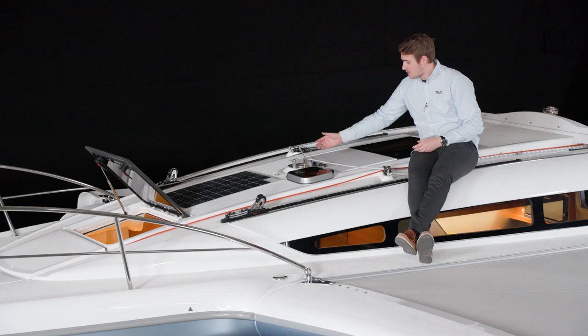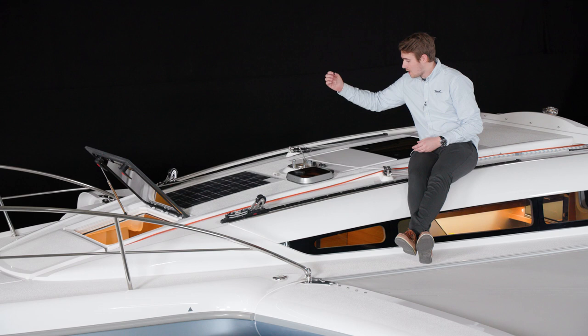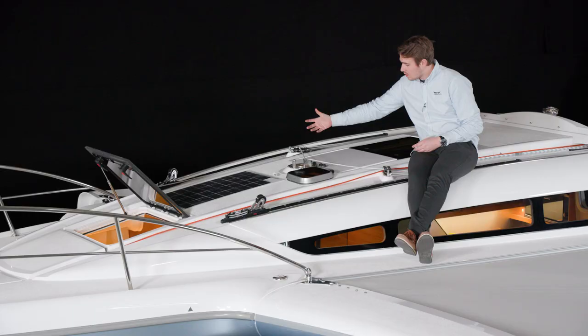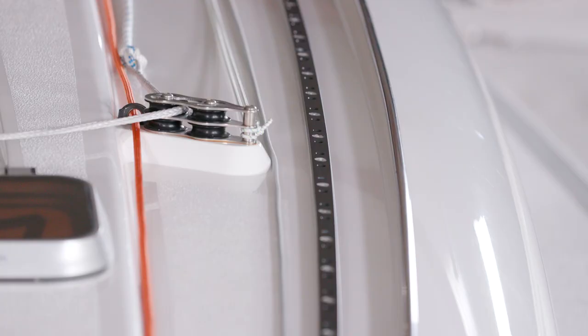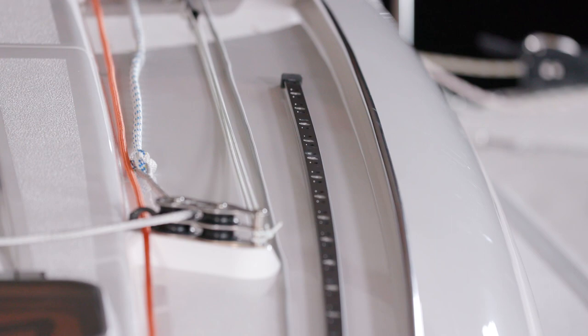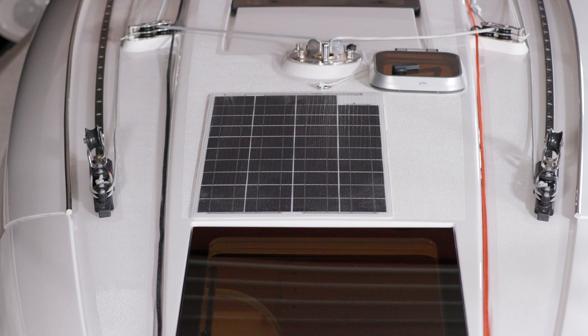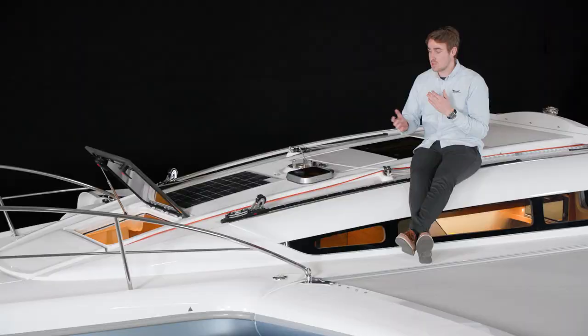As you probably can see, we have a rig that stands on the deck and in the mast base here, and all lines coming from the mast, so all halyards are led through the deck organizers here, directly back to the cockpit to handle and operate all the halyards from there. Here on the side, you can see we have two genoa tracks. These are adjustable, so you're able to trim the genoa to the perfect shape, but also to trim the genoa for a reef one or reef two.